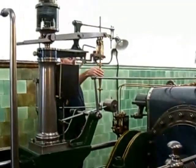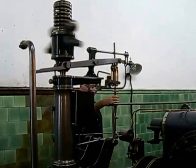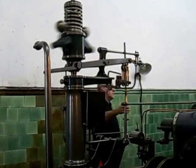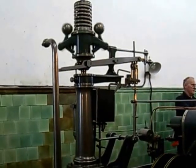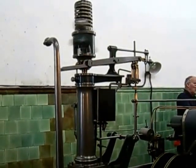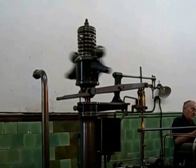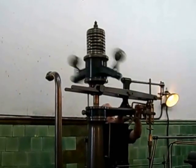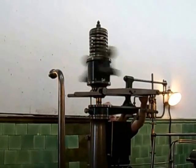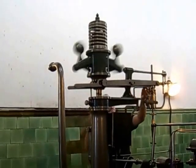The engine is beginning to turn under steam and as it does, we're going to speed up. The trick is to adjust the set point control to about the same speed where the engine can be stable. This is a critical operation because if they get it wrong, you can over-rev the engine and perhaps damage all the plant. Now we can see the governor wheels spinning up — see how it lifts up like that. It's just adjusting the gain of the system, as you would do electronically.